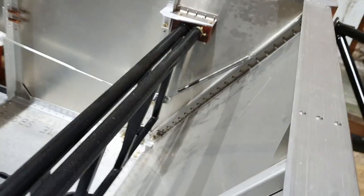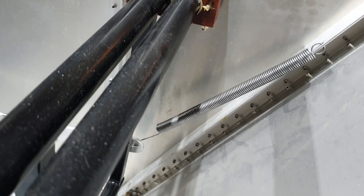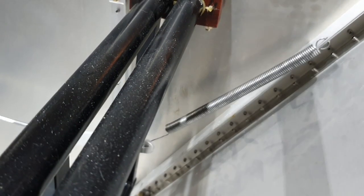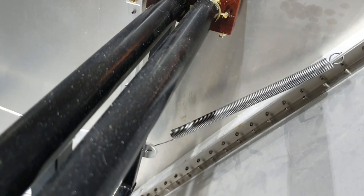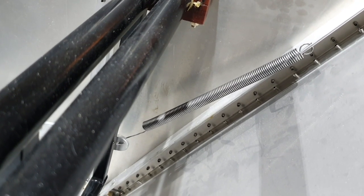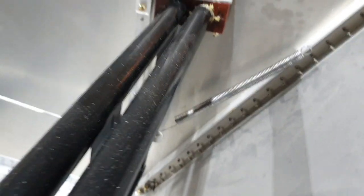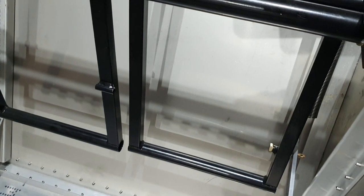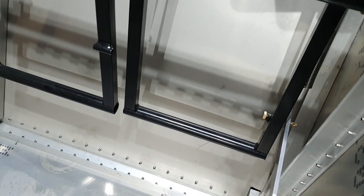Bending the springs was a bit of a challenge. The cables are held under tension with a spring when you haven't got your feet on the pedals. Basically you put the rudder pedal in the furthest forward position, put some tension into the spring, and cut it to length. The second spring I cut so that with the rudder pedals in the middle position — both level with each other — it didn't pull one way or the other, so it's neutrally sprung in the centre.